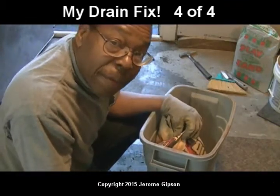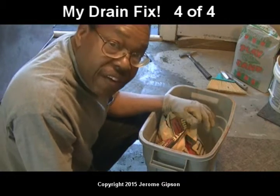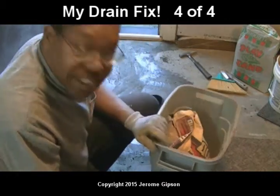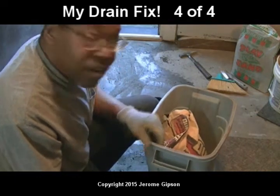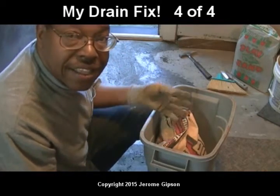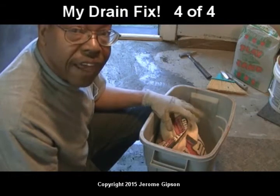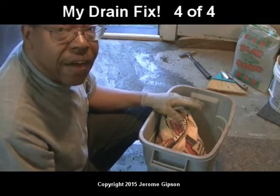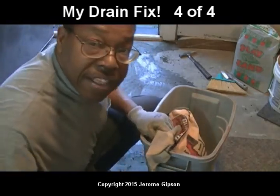I've got three quarters of a bag of cement left over. Now if I want to use it in three to six months' time, I store it in a plastic bin — this is a garbage bin — so no moisture can get in, because this stuff will suck up all the moisture really fast. The next thing you know, you've got a 60-pound rock wrapped in a bag. So that's how I store my excess cement. All right, take care, thanks for watching.